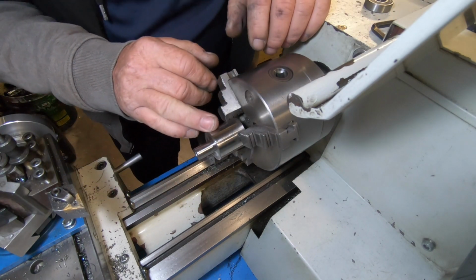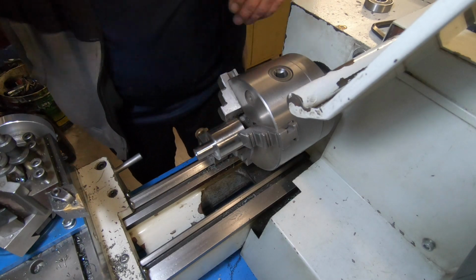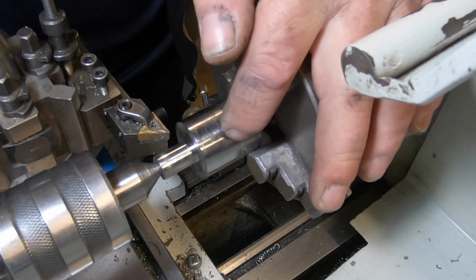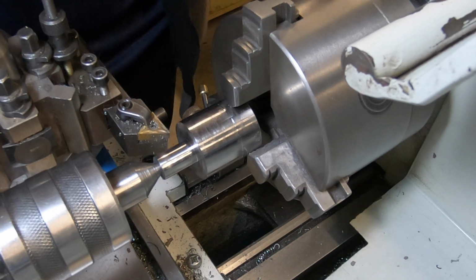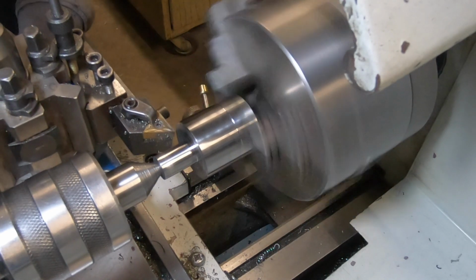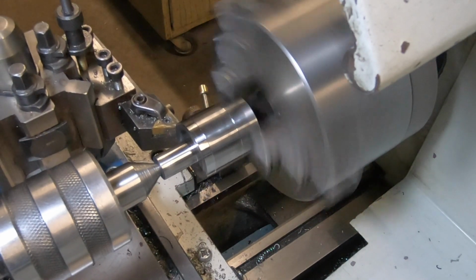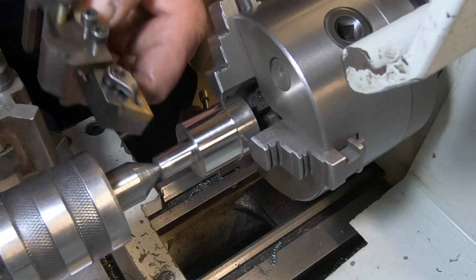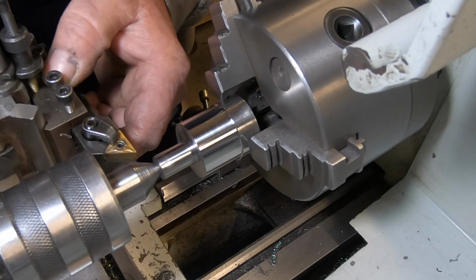So I've got to machine this next one down to take the big roller bearing. I use the dial indicator again and set the distance. You can see the little mark there. Machine this down. I've got about 500 there to come off it, so 250 aside. Turn that insert around. The good thing about these inserts, you get 6 cracks at them. That'd be fantastic.